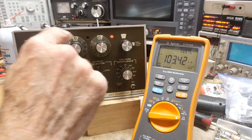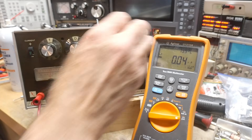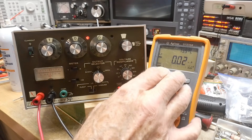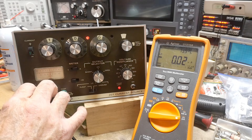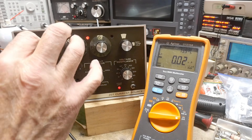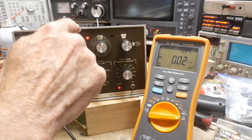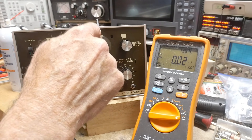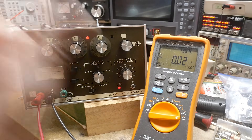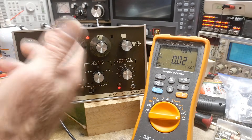Let's go to the microamps over here. So it's 100 microamps now — 100. And if I go another one, it's now 10 microamps, and it's not outputting correctly at the 10 microamps. So this is the smallest setting it has — 10 microamps — so it'll do tenths of microamps, so 100 nanoamps. It's better than I thought; not what I want, but it's better than I thought.